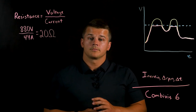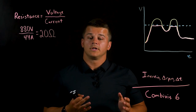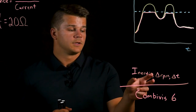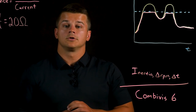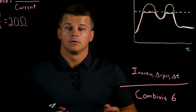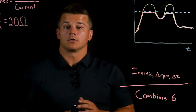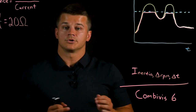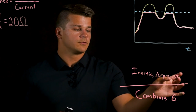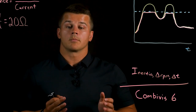You can do this two ways. The first is a little more involved, so we won't write all the equations here, but you can reference them in our braking resistor manual. Those equations require three variables: first, the inertia of the system — including both the motor and the load; second, your change in speed, for example from full speed of 1800 RPM down to zero, or smaller speed changes; and finally, the time — the amount of time required to make that speed change. You can reference the full equations in our braking resistor manual.